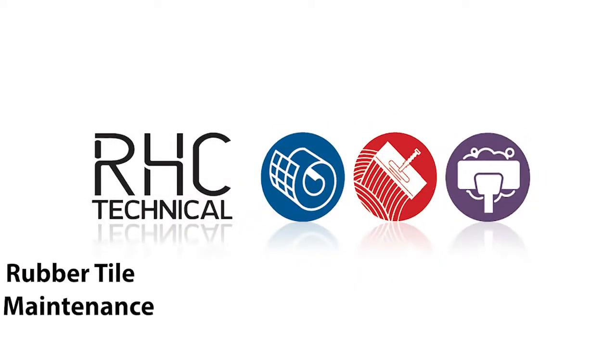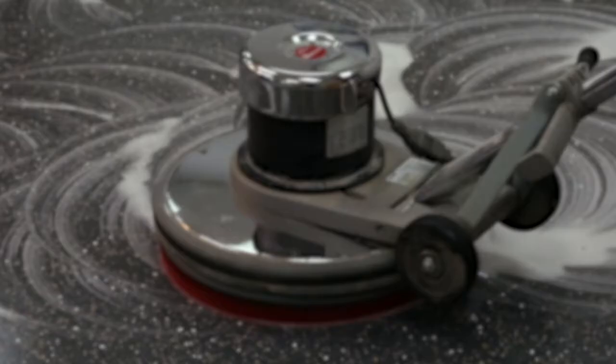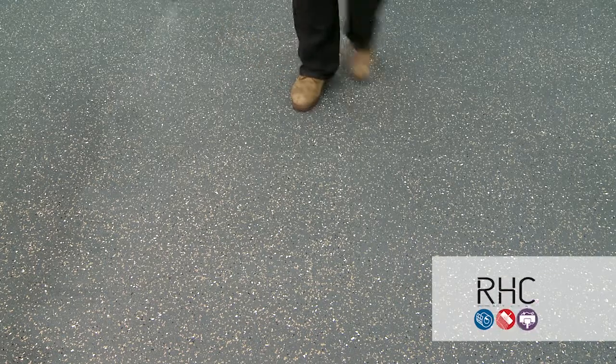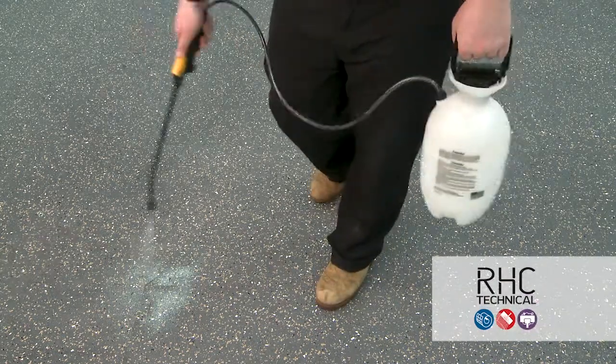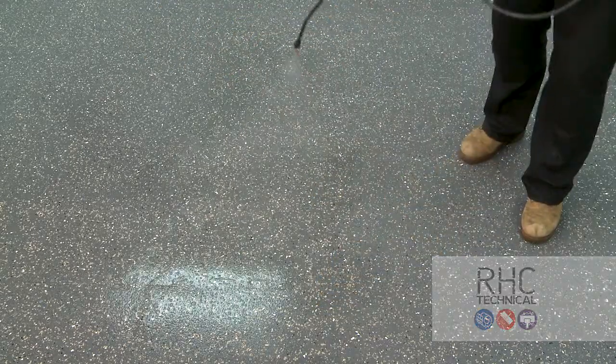In this RHC technical video segment, we'll demonstrate general maintenance and cleaning of Tuflex rubber flooring. We will be using Excelsior CM910 at a dilution ratio of 6 ounces per gallon for this general maintenance cleaning. Excelsior CM910 is a pH-neutral biodegradable cleaner and maintainer for the daily cleaning or long-term care of rubber-resilient flooring products.